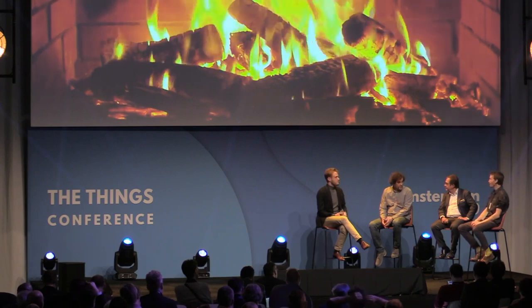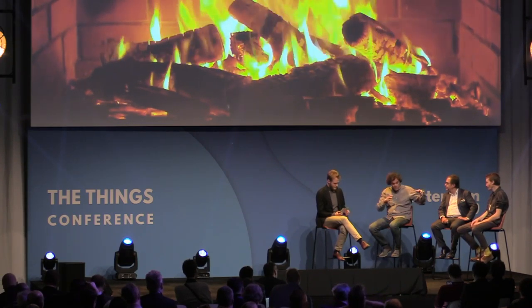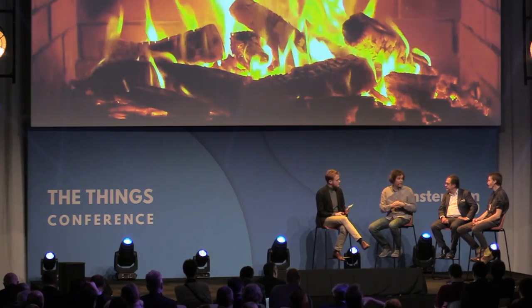So very early in the process, we realized that one day we would need something specific on the gateway, and that the gateway would need to be multiple channel, multiple data rate, so something much more carrier grade, like cellular, than just Zigbee. And we needed an efficient protocol, tailored for the Internet of Things, with redundancy between gateways, no handover, and a super small overhead. That's really special. You had to do that.